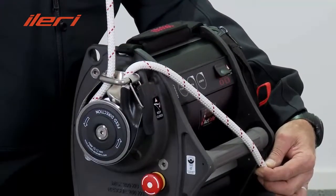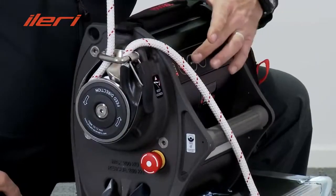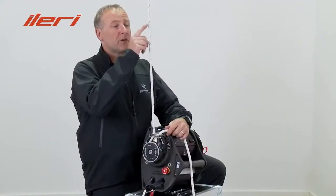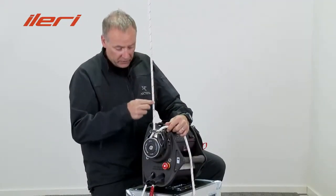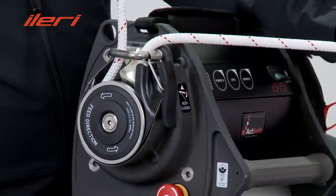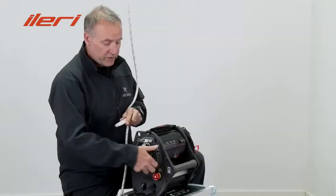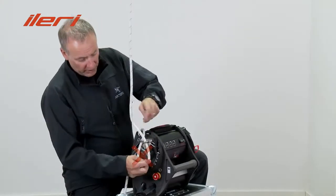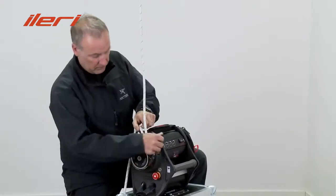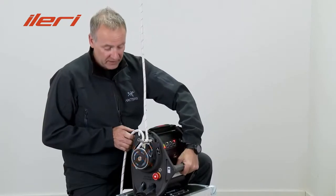Close the rope cover. If you have installed the anchor, you can now switch on the ACC and carry out the functional test. Just be sure that the rope coming from the anchors goes through the rope grab, following the arrows and going out on the side of the control panel. If you install the rope the wrong way, it will not be possible to carry out the lifting test.